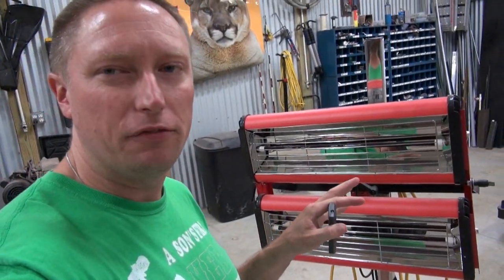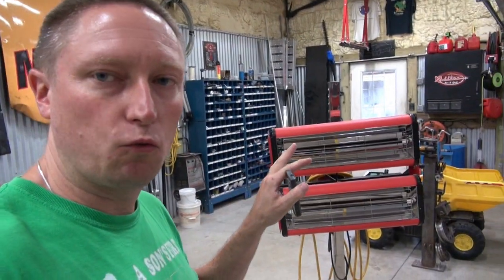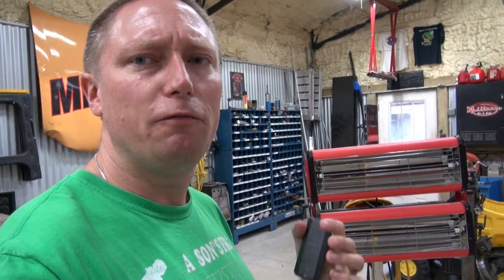When I did that first video I did not have an oven. I had an infrared light from eBay for around $200, and I heat-cured my parts by hanging them in front of that light with aluminum foil behind them to reflect the heat back. But when I checked with my infrared thermometer my parts were only around 150°F after 20-30 minutes, which got me thinking maybe they weren't fully cured.